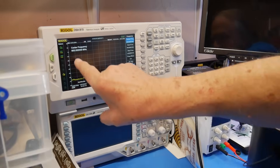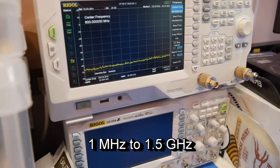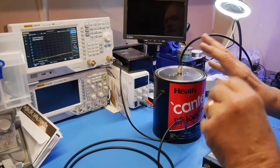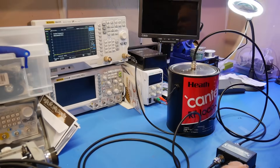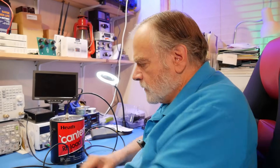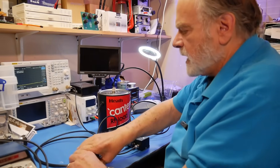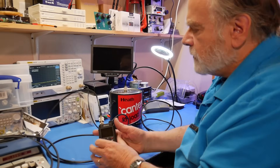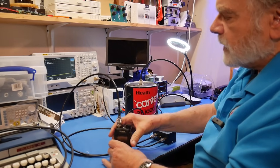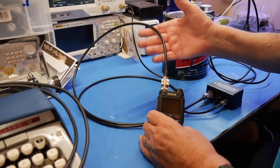I've got this set up so that it goes from 1 megahertz to 1.5 gigahertz. What we're going to do is we want to take the RF out of this and put it into here. The problem is the maximum input for this thing right here is only 10 dBm — that's one one-hundredth of a watt. So if we fed this straight into there, it wouldn't work. One way to do it is to put some sort of antenna here and then use this with the antenna. There are even those who say that you aren't really testing the entire radio system if you test just the radio, because the radio will interact with the rubber duck, which is usually not a very good load for a radio like this.